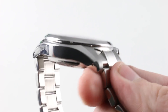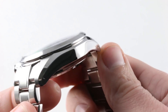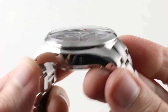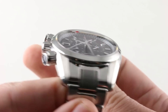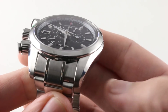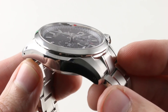The case band is beautiful. You've heard of the famed Zaratsu finish — optically smooth and mirrored, almost like Swiss black polish? Well, it's for real. It's a tin plate polishing technique, and I've seen it performed, whereby the artisan holds the side of the case or the bracelet component physically against a spinning tin plate. A combination of eye, feel, and experience dictate the result. And considering this is done by hand — pressure and eye — it's amazing how symmetrical from side to side the result is, as well as the consistency of the outcome. That's the value of having not just a human being finish your watch, but an expert human being. There's a nice contrast between the sheer of the side, which is nevertheless not as flat and squared off as a Rolex case. It does have a little bit of a sexy curve to it, and you can see the flame surfacing effect, attesting to the compound curvature.